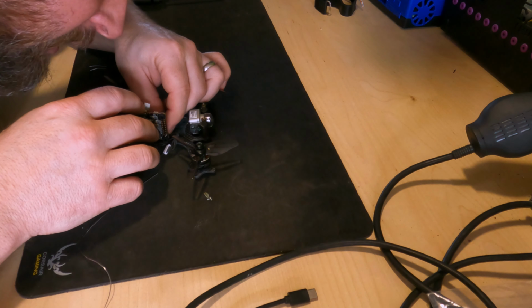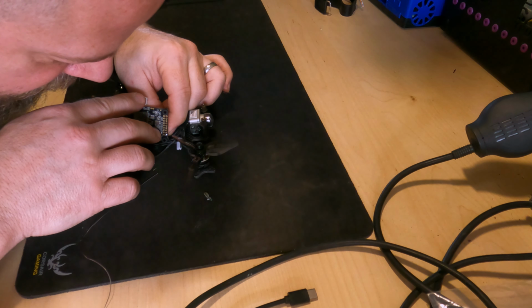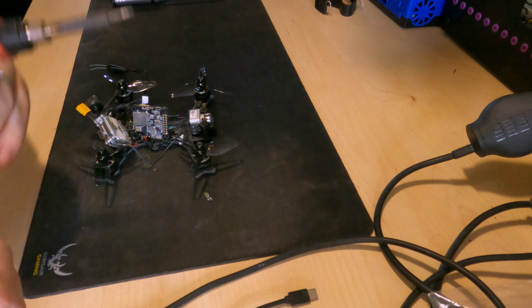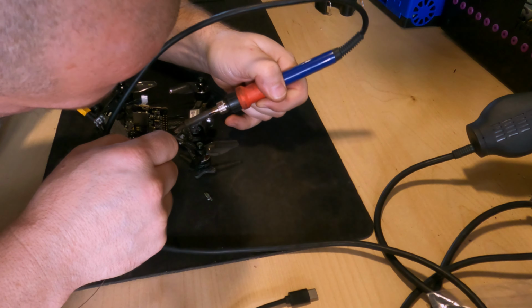And these boards, the pins are not always entirely lined up with the board print. It's slightly offset, so you have to work your way back or look at a pinout diagram.